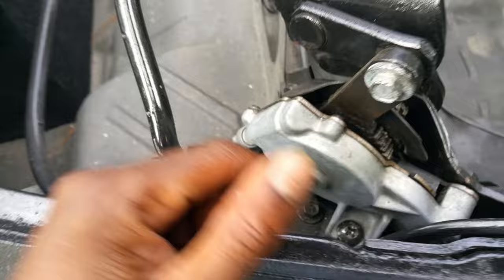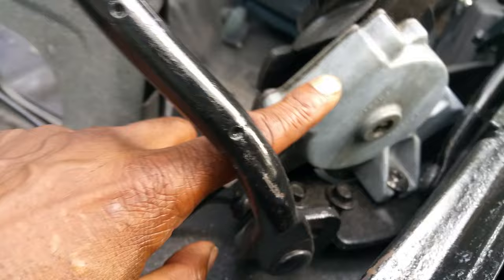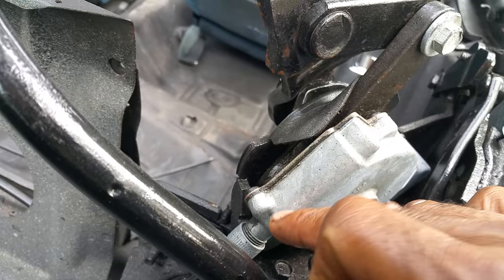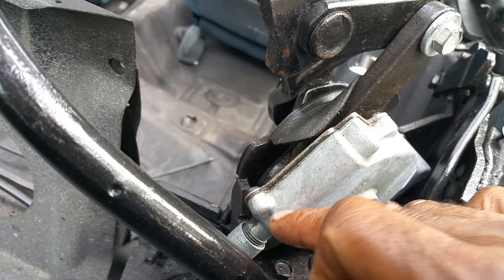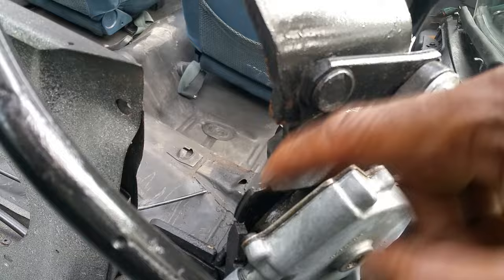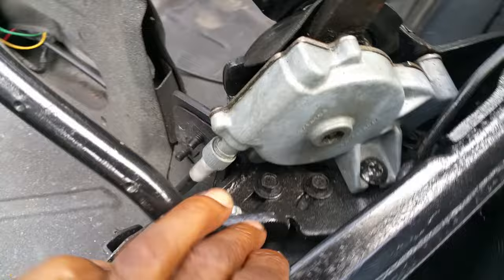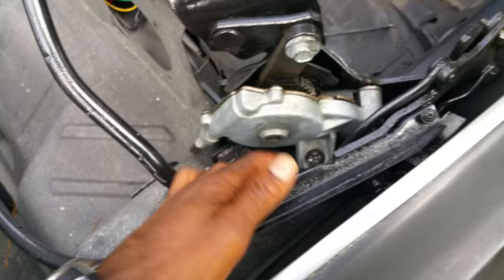Sometimes they bind up right here in this section. Old gummed-up grease gets in it because it's like a spiral right here — this is about the smallest part of it. This gets gummed up with grease and the top won't work because it just binds up when the spiral is trying to turn this big main gear. So you want to get in it, take it apart, take the screw out — you'll see all your gears. Take them out, scrape them all out, put some fresh gear grease, repack it, and they should be good. They shouldn't bind. When you take it apart, check the teeth — make sure the teeth are good. If they're good, just repack it and it should work no problem.